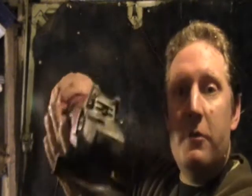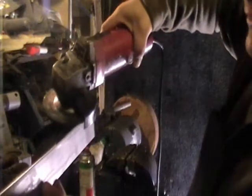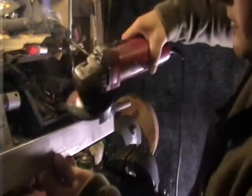Cutting discs go onto the material and you cut that way. Grinding discs you use on the side and do them this way. So if your material was like this, a cutting disc you use like this on its end. Okay? A big old grinding disc has a depressed center, and you do that with it to remove material.